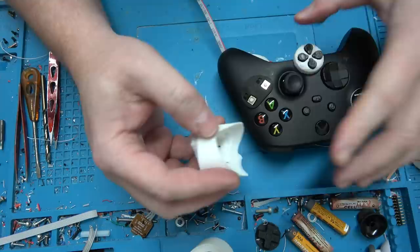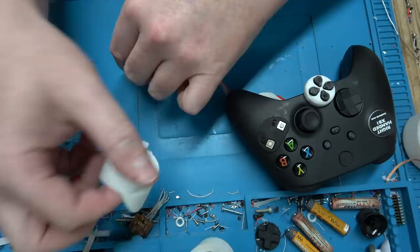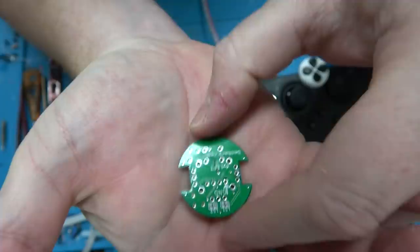So how I used to do this before was I would put potentiometers into this plastic casing, which would fit at the base of the controller. Then I would wire these potentiometers in parallel with the analog stick so you could adjust where the center point was, since this is meant to sit on your leg. Wiring that up by hand was kind of a pain, so I made some more circuit boards.